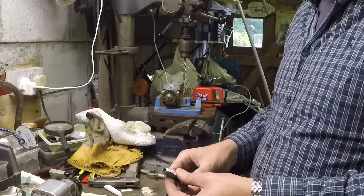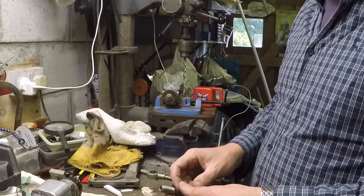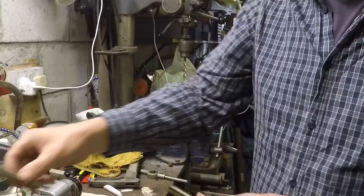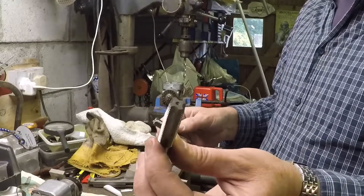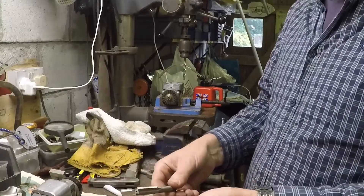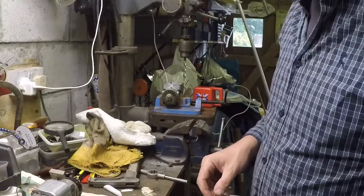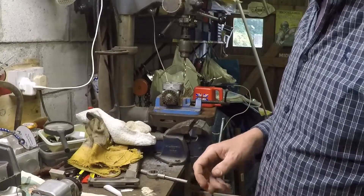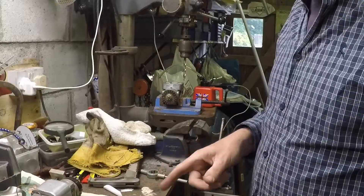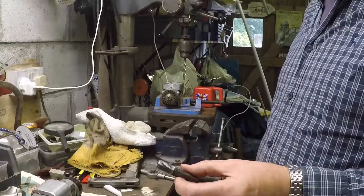So I'm going to drill the magneto body now because I don't want to cut this thread and end up with it too loose. I prefer to drill and tap the body of the magneto half-inch BSF. I've got half-inch BSF taps here — a starting tap with a taper on it and a finishing tap which is much more square, and they're nearly new. Plug for Tracy Tools: if you need taps and dies I always get mine from Tracy Tools — they don't sponsor me but they're very good, mail order, not expensive, all manner of funny sizes.